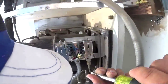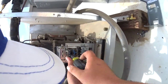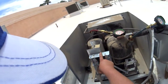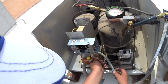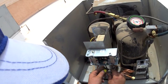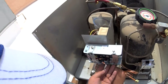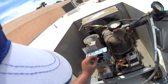The pressure control that I got goes up to 500 pounds, and then we'll just set it for 450. It's more appropriate. So that's what we're gonna do. And I had to put this one here because this is where the conduit will reach, barely. Hopefully, if not, I can lower the box down a little bit more. Yeah, nice. There we go. And we're gonna have our load.